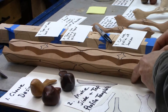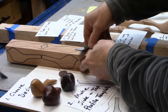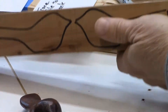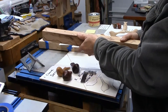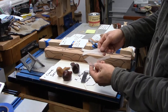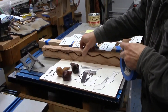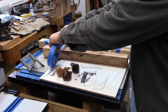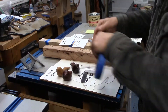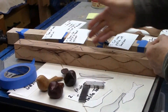You'll need to put the cut pieces back on and align them, extending lines at the beaks down the side of the piece of wood so you can take the side profile template and mark it out all along the blank. Then tape it back up so you can cut it on your bandsaw with a quarter-inch blade. One more note on templates: while flexible plastic works, cardboard or anything stiffer will be easier to maneuver your marker around. After cutting, tape all the pieces back together and use the template again over the tape so you have a clear cut line.